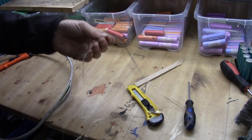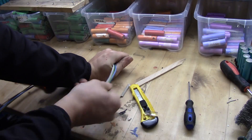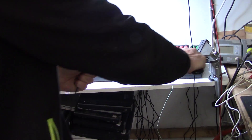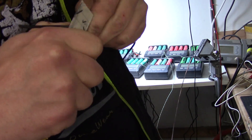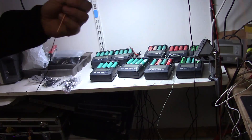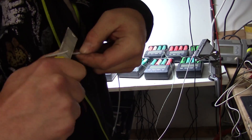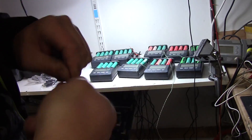What you get here is kind of excellent fuse wire — it's not the fuses themselves but it can be used on the other side, so I saved those. Basically put the cable in your vise, take your knife and drag it along while tensioning pretty hard. To determine the thickness of the wire: I'm going to use 80 amps at most per pack, and I'm using six wires at two and a half square millimeters — each can cope with at least 16 amps, so six of those should be over 90 amps without any bigger losses.